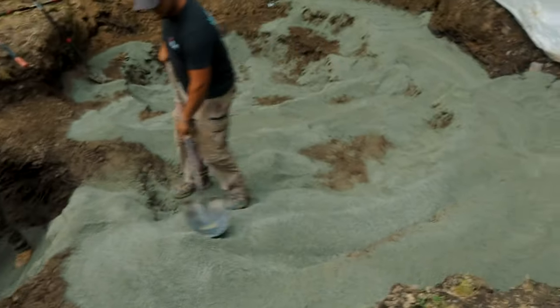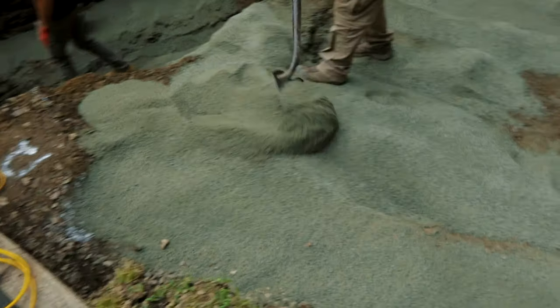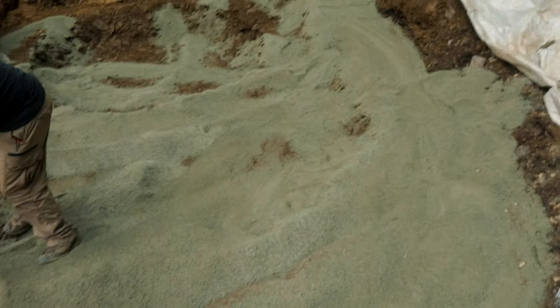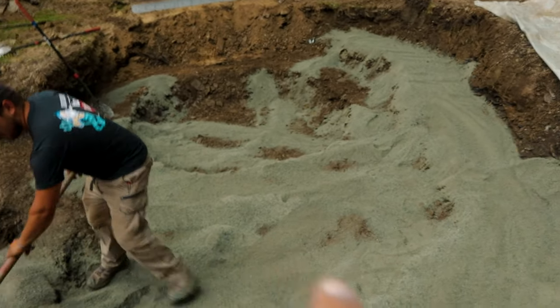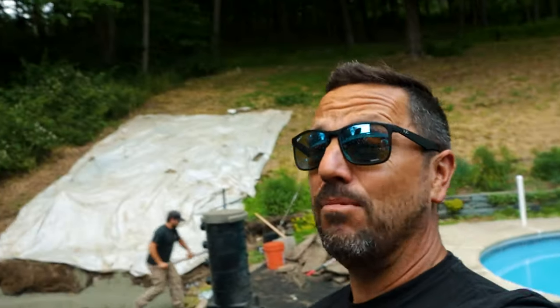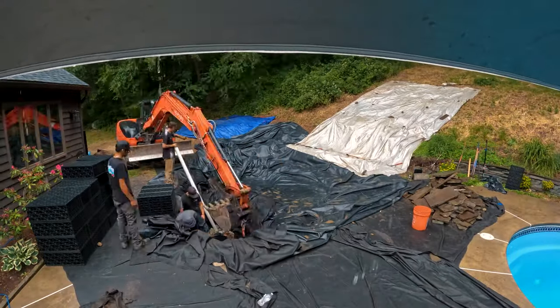We got our excavation roughed in. We over-dug to allow for our stone dust, and what Colby and Bully are doing right now is putting that whole layer of stone dust in — it's just a really fine granular material. The stuff packs in real nice and actually makes a nice cushion for our liner. We're going to coat all these horizontal shelves and run some down the sides as well. When we set our boulder work inside the liner, we can do some backfilling with gravel to get that horizontal shelf. We've got to get moving — there's a big rainstorm moving in. We want to get this liner in tonight. We're going to batten down the hatches; Anthony already covered the hillside with a tarp. We're going to cover most of our exposed dirt with tarps and rocks and hopefully it stays semi-dry so we can keep rocking tomorrow.